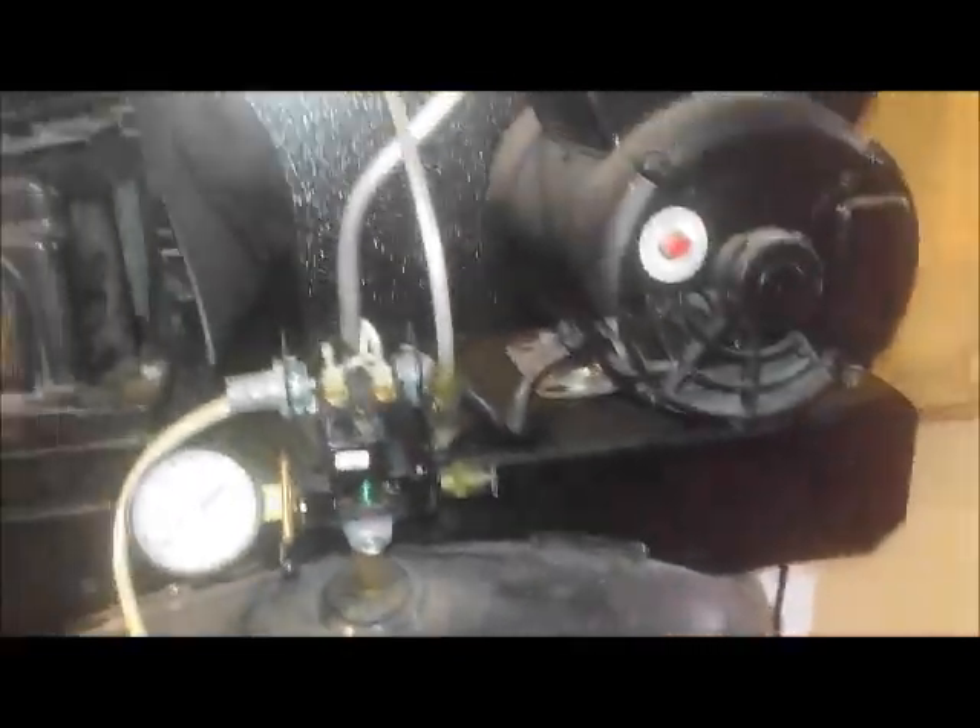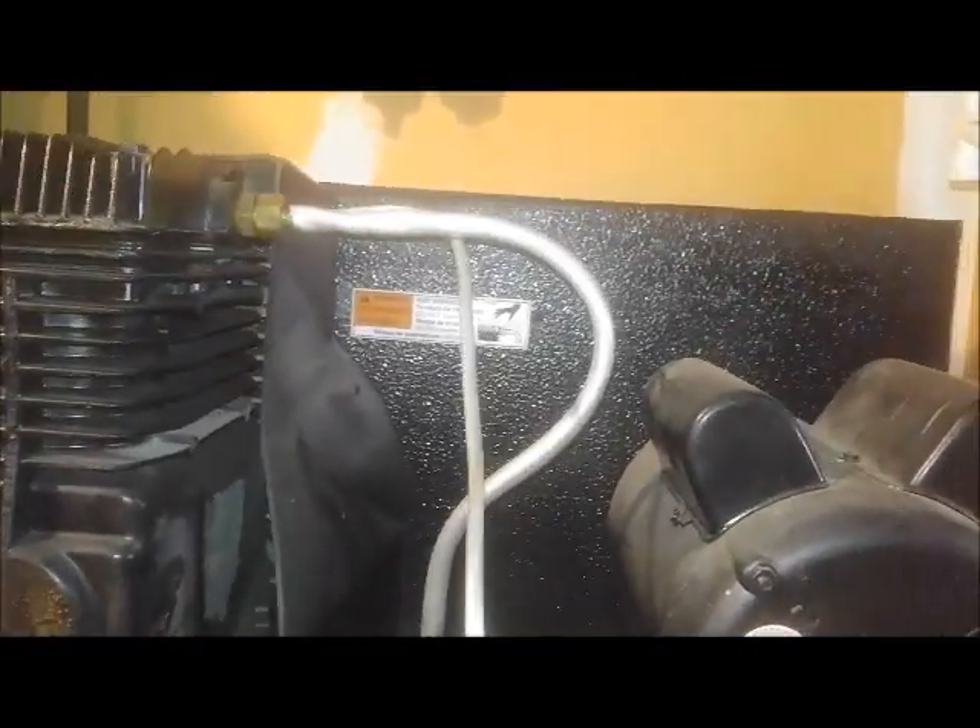The reason why I chose to use rubber here and hard line for the rest is because I want this motor to be able to vibrate independently from all of my lines that are screwed to my wall. I didn't want to worry about vibrating the wall or making bolts come loose, so that's why that section is rubber.